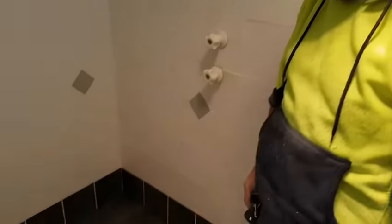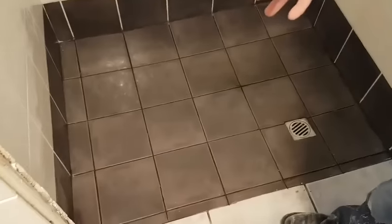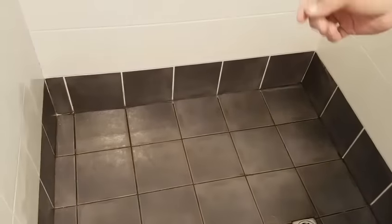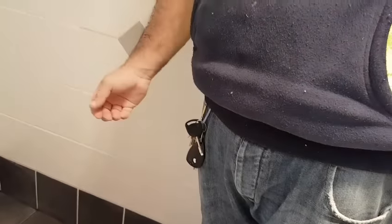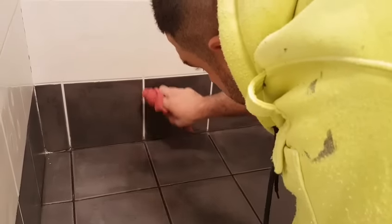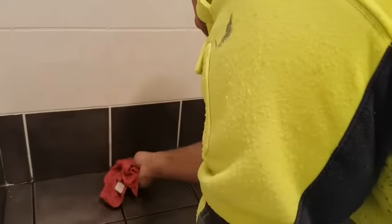We have regrouted the walls and the floors. Now with dark floor grout and light wall grout, it is inevitable you will get some black onto the white. Right after you clean everything up, run a damp cloth with your finger at the tip down the white grout line — this pulls the white colour back and gets rid of the majority of any black overlap.